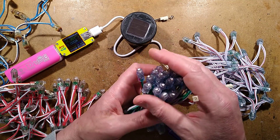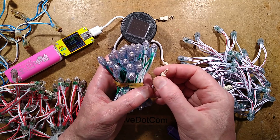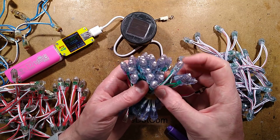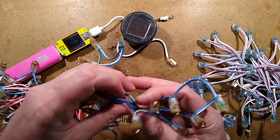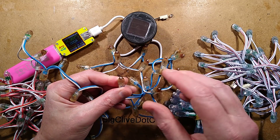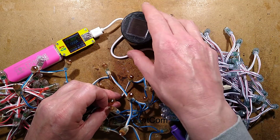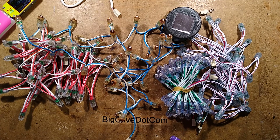If you want to make them last longer and don't need them so bright, you could include a 1 amp or 3 amp diode in series with each section, which would drop about 0.6 to 1 volt and reduce power dissipation of the LEDs. I'm definitely impressed - the ones from 8 years ago are degraded but still mostly lit, which is very impressive. I think I may actually replace these with some new ones and refresh that planter. But there we go - classic, generic, single colour, dumb, simple LED sign pixels from China.